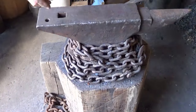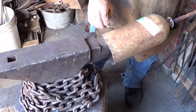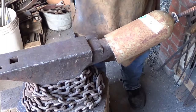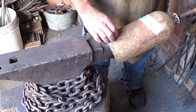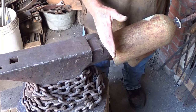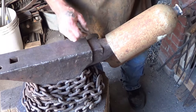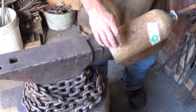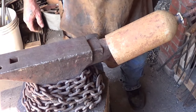I think I can work this over the horn. You'd think you'd just be able to flare it out and be done with it — maybe I can do it that easily. If not, by stretching the steel on the outside, it'll increase the diameter and that's going to force it to curl. So if I can't just flare it easily once it's hot, I might have to stretch that steel out with a cross peen and flare it. That's the plan — let me get this thing heated up.